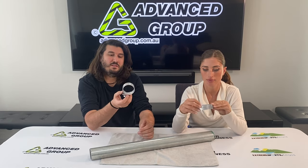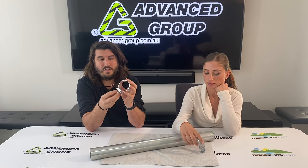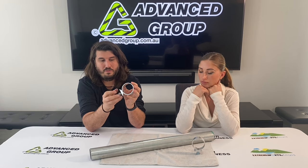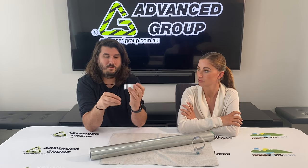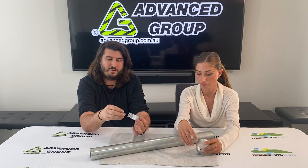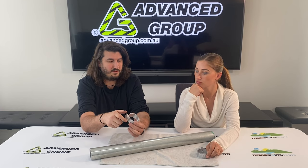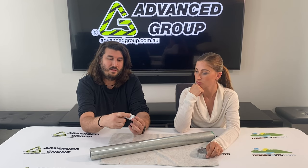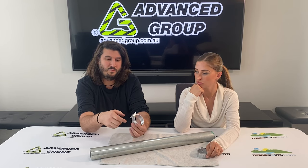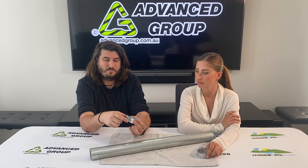Is that all we need to know about these? The last couple of things to mention is what they're made out of. This part of the bracket is aluminium — a marine grade aluminium and it's very strong. This will have some flex in it when you're doing the bolt up against the pipe, so it will elongate slightly when you're doing this up, which also helps it grip onto the pipe without being able to rotate around the pole at all. The strength of it means it can do the heavy lifting when it comes to holding a large sign, which has a lot of surface area in a windy location with big gusts or gales.